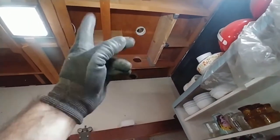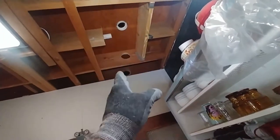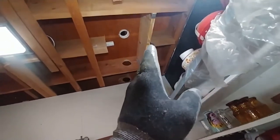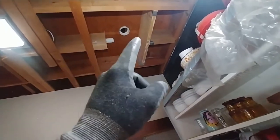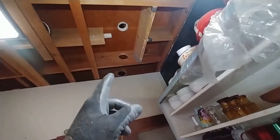Now, we ended up right on a joist here with the toilet, as it happened upstairs. So I had to quickly lop out that piece of the joist. What I did was I cut it out so that when I had it off on both sides, the center line of these two pieces that had it off will be at 16 inches. Anyway, the idea is that we aren't asking that plywood to do any more of a span than, you know, 16 inch centers or 14 and a half literal.